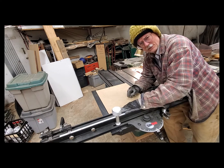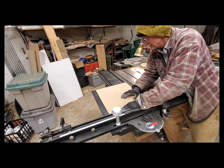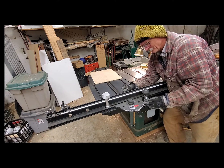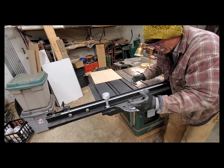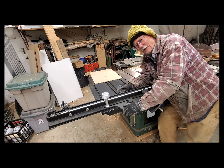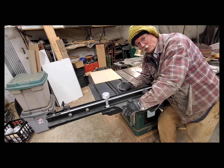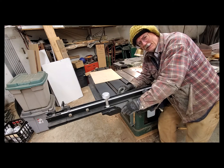When this came up from a friend of mine I couldn't pass it up. But here's the rub: it's got this supposedly gorgeous miter gauge, but the little bar it has is very short and very sloppy in the slot. There's no way it's ever going to end up at 90 or 45 — particularly 90, which is where you have to work almost all the time. So let me show you the fix I made.